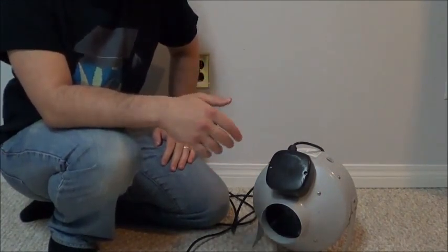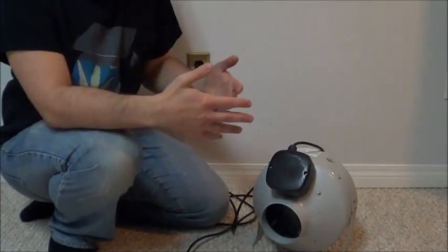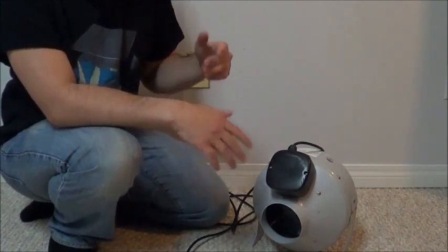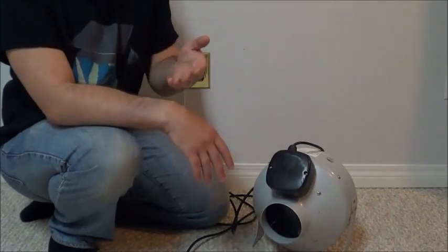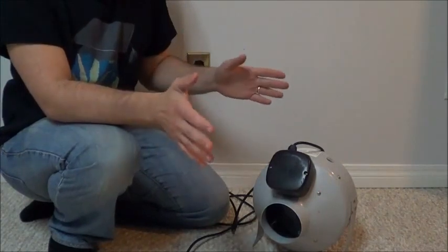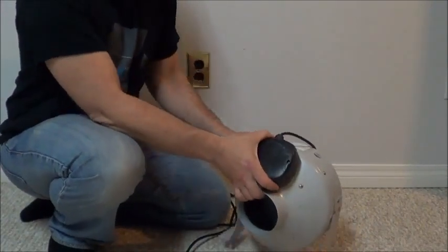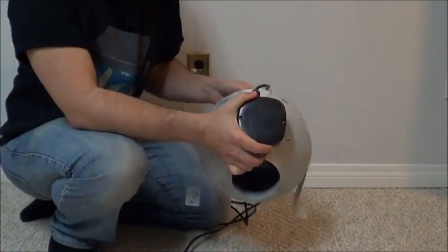Inline fans, much like the carbon filters I discussed in a previous episode, measure how much output they can handle in CFM, cubic feet of air per minute. You should be changing out all of the air in your room at least 30 times per hour. 60 times, or once per minute, is even better. So, in your 175 cubic foot room, you wouldn't need anything bigger than a fan that can move 175 CFM. This one can actually do 190.